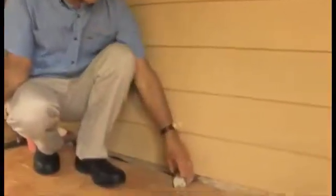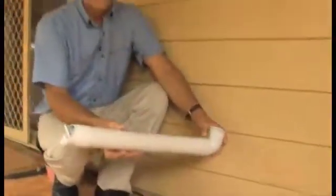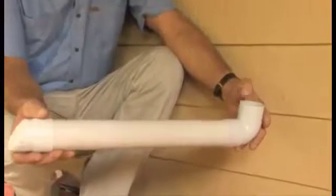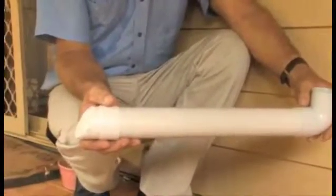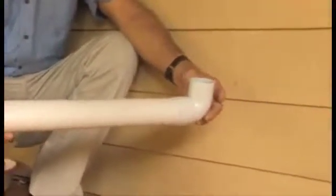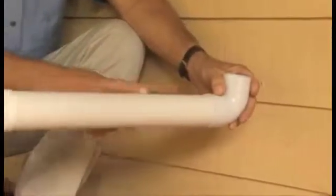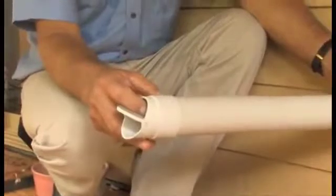Alright, the second fitting we need to look at outside the house is this thing here, which all we can see at this particular house is just this flap. But what it is actually is one of these things here, and it's called a dry floor waste. In your laundry, for example, you might see a grate on your laundry floor, and it may very well be hooked up to something like this grate in the floor. It runs straight out underneath the floor and out through that flap.